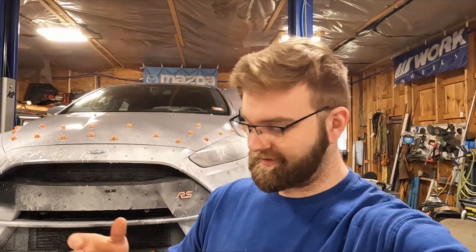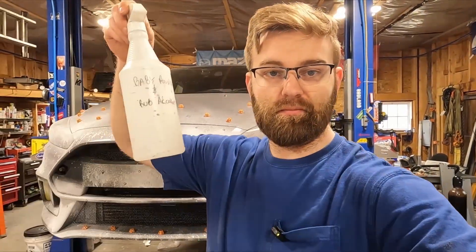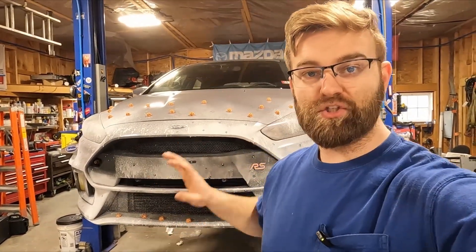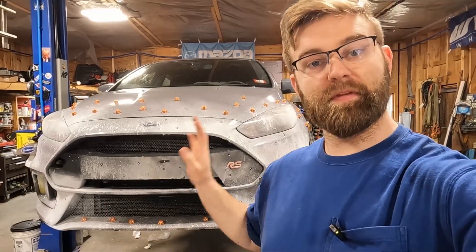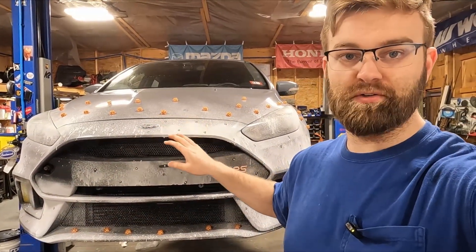Pardon my sniffles. As you can see, the front end of the car is coated in a white powder. It is a baby powder and isopropyl alcohol mix that just makes 3D scanning way more accurate and consistent. Shiny surfaces it doesn't do so well with, so this just gives me a nice matte surface. It doesn't affect the texturing — it makes the scan quality come out way better.